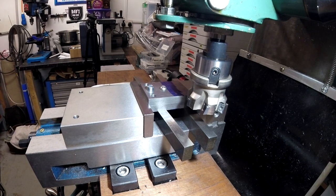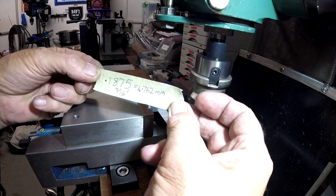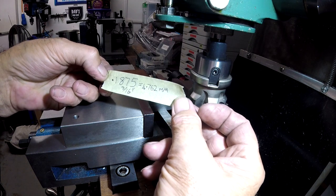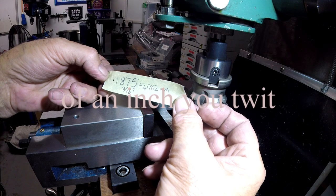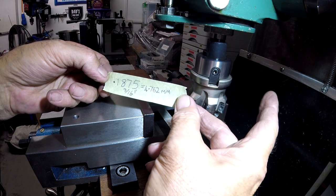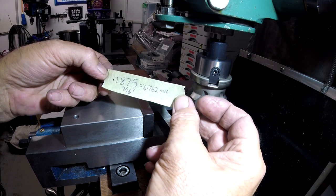So that's pretty much set up to cut these slots. For anybody that's interested, that's not into particularly swapping imperial and metric, the depth of cut we're going is classed as 3/16 of an inch on the drawing, which is 0.1875 of an inch, and that comes out at 4.762 millimeters. Not doing it in metric, I'm doing it in imperial, so I need 0.1875 deep cut,